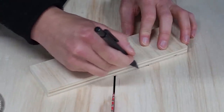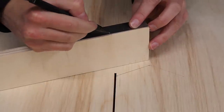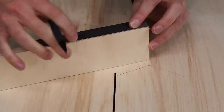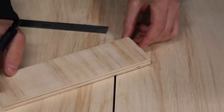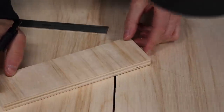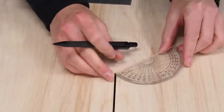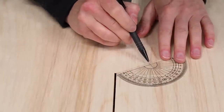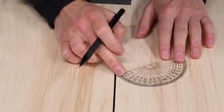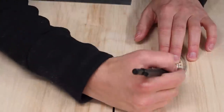You'll need a few small pieces of plywood for the next part. On the first one, I measured 2 inches since that's the size of the hexagon I want to make. I positioned it so the 2 inch marking lined up with the kerf line and marked off the other end. Here I'm making the second mark at 120 degrees. Note that it can be tricky to get the angles just right, so you may need to tweak them a little bit to get the jig perfectly dialed in.